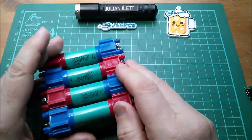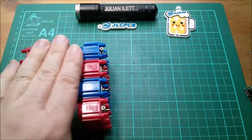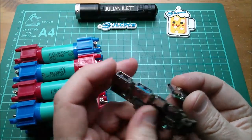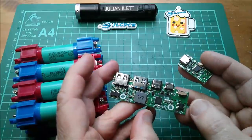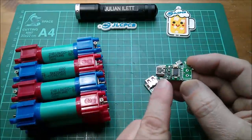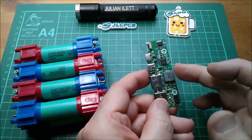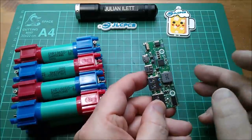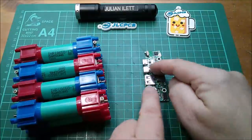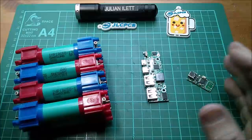With a single parallel pack and one of these boards, plus a USB Type-C to Type-C cable — I might pop into town to get one — this power delivery board should be able to coax the PD chip on the board to boost not to 5 volts but to 9 or 12 volts. PD also has 20 volts as an option but these boards don't have that. So it should be possible for this device to send commands down the USB and tell this device we want 9 or 12 volt USB, but I'm going to have to come back and do that as a separate video.